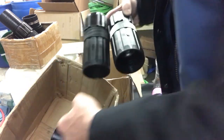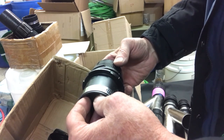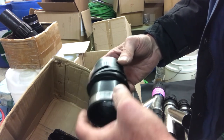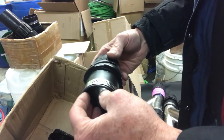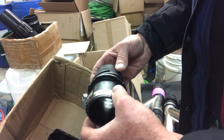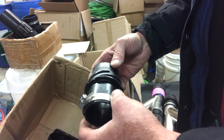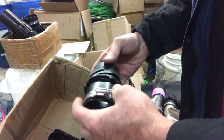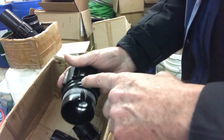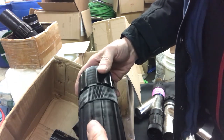Let's start at the truck. The starter cuff goes on to your intake port. Most two-inch intake ports are barbed, but unfortunately that's a restrictive type of fitting. I wish we could get away from that and go to true two-inch ID cuffs using ports that are metal-walled hard wall — not restricting so much — because we're trying to get better vacuum and be efficient and fast and easy. Cool Cuffs were the first true two-inch ID hose connectors, the first two-part patented locking, swiveling, tapered threaded connection that blocks off any leakage, and then later made to swivel.